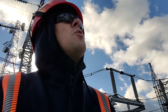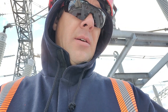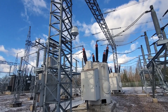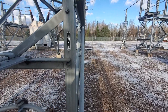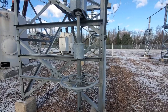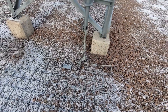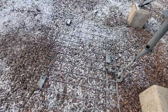So had that operated properly, our next step would have been 6B14 — same deal: close, check closed, locked. I'm not sure where that is but I'm going to assume it's the switch on the other side of the breaker. I use the word assume but you do have to verify — you can never assume without proper verification. So 6B14, there's our tag — I confirmed the permit number on the tag. The last step would be to close 6B14, verify all three are closed, and lock the handle in place. Before operating the switch, we do have to confirm that the bonds and grounds are all in place. The structure as a whole — you can see there's a bond going right down to the ground grid, and our switch is bonded to our grounding mat.